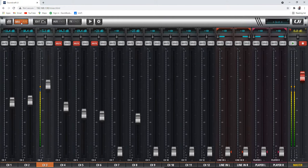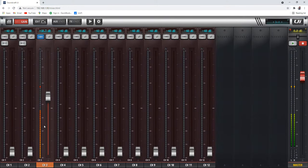Now, if we click again, we're going to go to the gain page. This is where we set gains. Much like an analog mixer, before we use this, we have to come in here and set our gain level for the microphone. In this page, we can also turn on phantom power. For channels one and two, we can turn on high Z if we're going to use a high Z input. There is also a phase button. You only go in there when you need to adjust gain for a microphone.